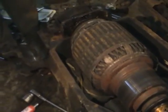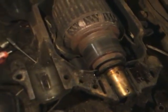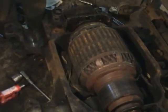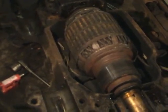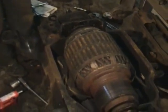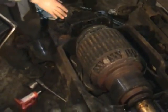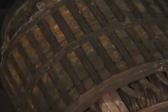What's next on these is we've taken them apart. He looked at them and said we've done what we should — we've made it easy for them, because they will then clean them up. The hard part was taking them apart, taking these very nasty bolts apart and so forth. Then we will put them back together and they will take them up to their shop either in Lewiston or Bangor depending on the type of work. The first thing they'll do is take the armature out, clean it very thoroughly, steam clean it, bake all the moisture out, and clean off bits of rust, then impregnate it with a varnish that will seal the moisture out.